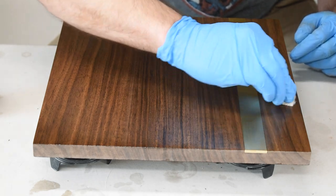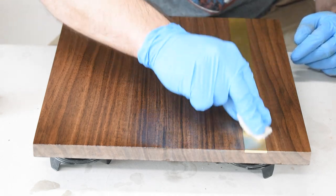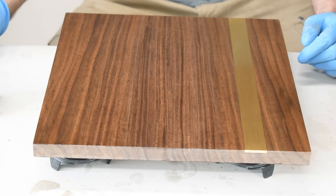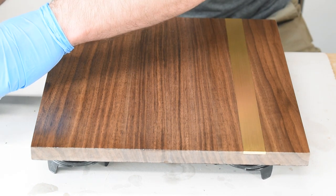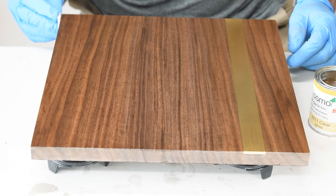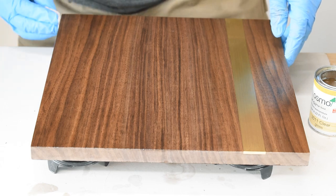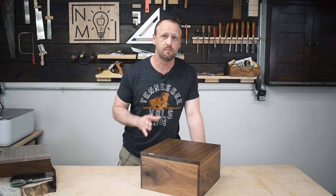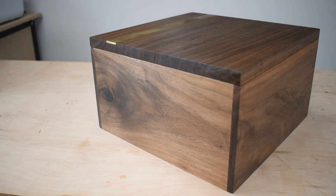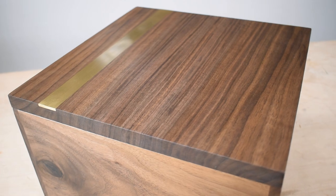If you're having a problem with your finish adhering to the metal, here are a couple of things you can do. One, you can apply a wax finish over the top of your project — for my case I'm doing a hard wax finish, so I know I'm not going to have any issues on the wood or the metal. If you don't want to do that and you want to apply a film finish, then you may have to mask off the metal, apply the finish, and then apply wax or some sort of buffing compound specifically to the metal to shine it up. I've probably made a couple dozen modern-looking boxes like this that incorporate metal, and I have to say this one might be my favorite. I love that walnut lid, especially that linear grain with the brass stripe — those two just work absolutely perfect together.